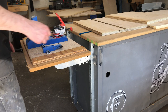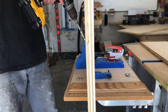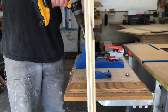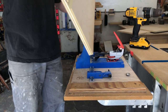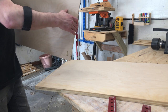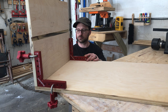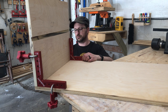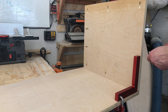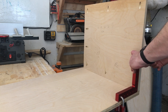The bulk of the cabinet will be made with pocket holes, so we get set up to do that and batch a whole bunch of them out. The main way we will be fastening this is with glue, reinforcing with pocket screws. In this case the pocket holes will be on the outside because they're going to be covered later on — you won't see them. Use a couple of squares to make sure that you are square, then go ahead and screw in those pocket holes. Same for the opposite side — this is the inside of where the drawers are going to be, so I have the pocket holes on the inside because you won't see those either.